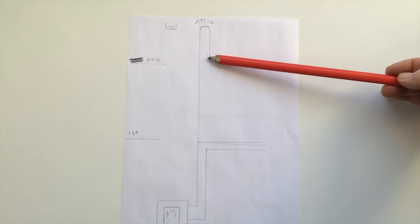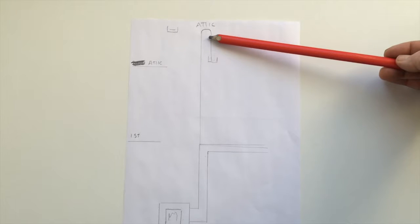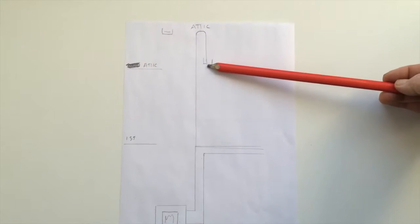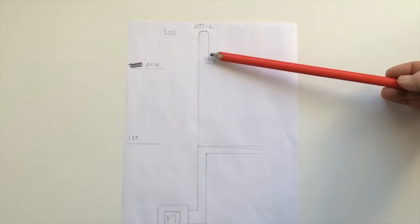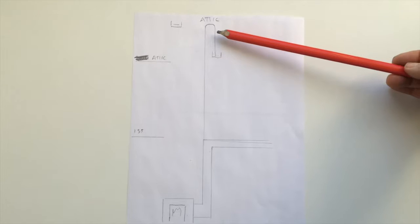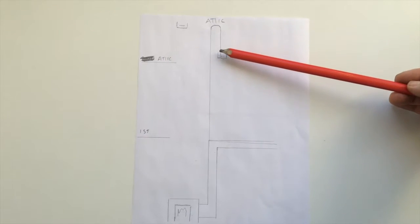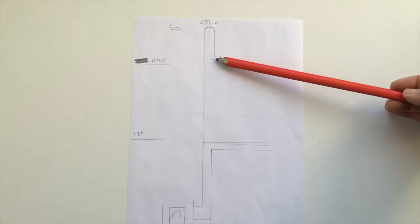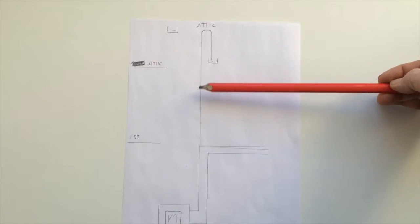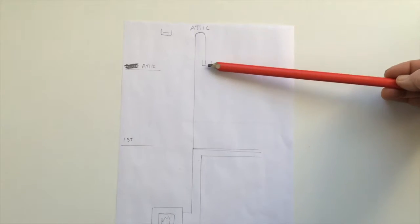But it's very important that this pipe is here. And we're talking about maybe the guts of 2 meters of a fall here into this tank. And once the water starts falling into that, it's going to create a siphon effect. This is more or less how your toilet works when you flush it every time. It's going to create a siphon effect, so it creates a vacuum in this side of the pipe. So the water coming down here draws the water coming up there.